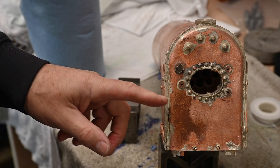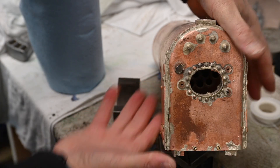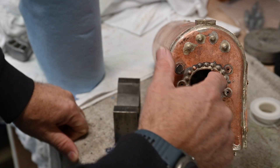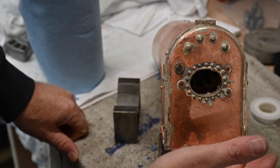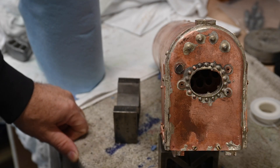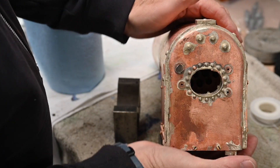I've done a water test on it just around the firebox area and I haven't got any leaks there now at all. Inside of the firebox door liner is all now brazed up. I brazed the corner up where there was a potential for a leak — well, it was not potential, it was leaking — so I've now brazed that corner up and I've brazed the inside of the firebox. So now this end I know doesn't leak.